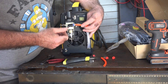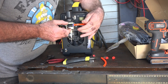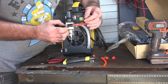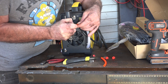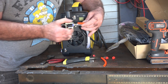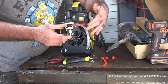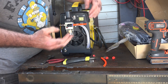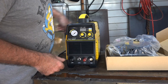Once you've got that sorted out, all you do is poke this hose in there and you'll hear it go click - you can feel it too. If I try to pull it out it won't come out, but I can get it out by grabbing this blue ring - hold it down and then pull the pipe out. But if you don't hold this blue ring down you can pull as hard as you like and you'll just break the pipe. Push it in and you hear it click. I wouldn't pull it in and out more than five or six times because the o-ring will start to get damaged - that's just how you get it out if you make a mistake.